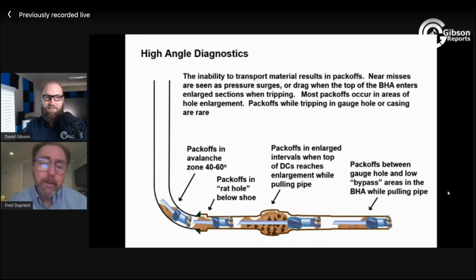So we'd need something like this every 15 feet, almost. I'm sorry? So we'd almost need one of these tools every 15 feet. You already have a tool joint every 30 feet. With the same OD as your drill collars, your velocity is going to go up around every tool joint.